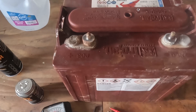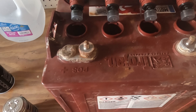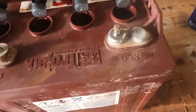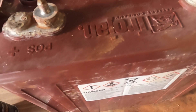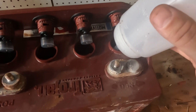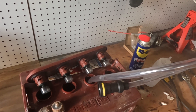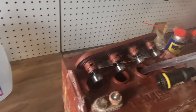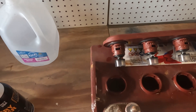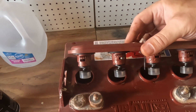What's nice — I've got the Trojan HydroLink installed, and it makes everything up here watertight. So what I can check now is the water in the cells to see if it has any rust in it. I'll suck some out — and it's rust free, it's clear water. So that's good. I checked all four cells, all four tested clean and rust free. I'll put it back; you can see the rubber seals, which makes this a really nice application.